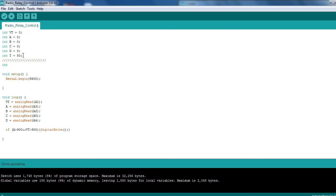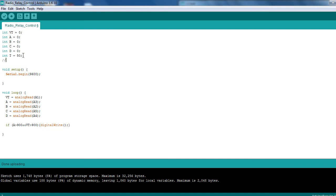So int, in fact we already know what pins are on, but don't really need to create that. So what I'll do is just go here, do pin mode, because I want to set the two up for pin mode. So digital pin 2, and we're setting that high, because that's on the loop when it first starts, so we don't want them to actually switch on as soon as it comes on, so that's why we're setting them high. And obviously the boards are looking for a low, and obviously we're using digital 4 and we're setting that high also. Sorry, I'm actually doing that wrong. That needs to be output, sorry, my bad. And the other one needs to be output as well. I'm thinking of digital write for some reason.